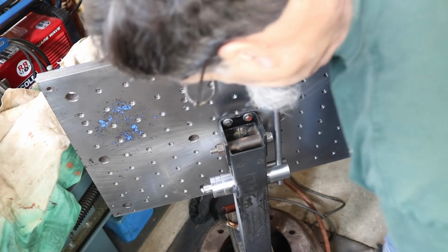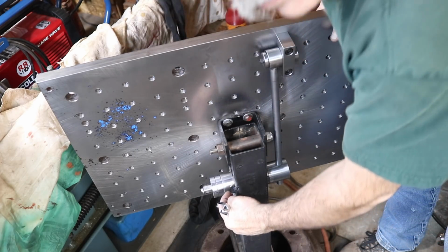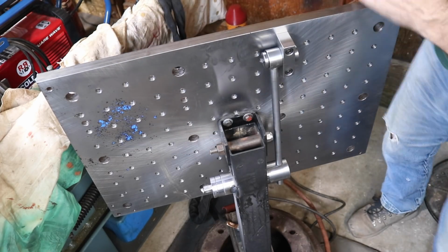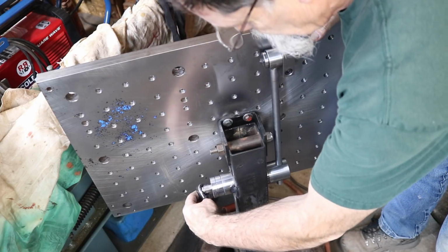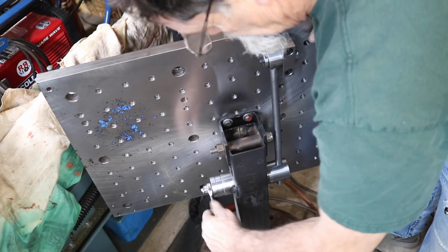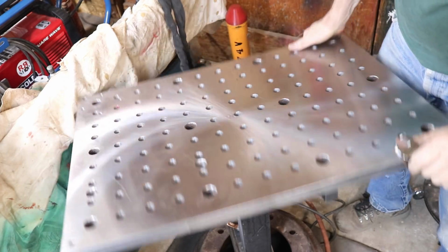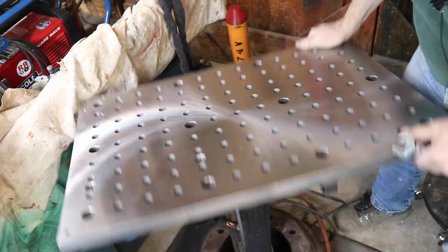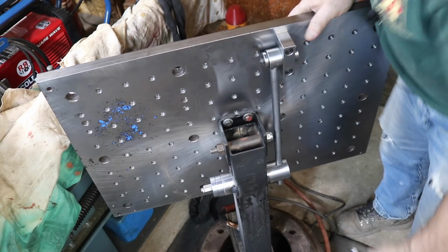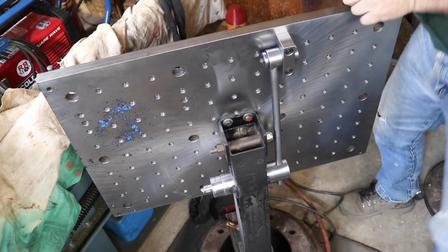We're welded in. It was pretty nice since I could actually just fusion weld that. It was such a nice tight fit, so that's all I did. But anyway, the wrench goes on there, and all it's going to do is take about a third of a turn to tighten it. It works very nice, boom, nice and smooth. And boom. I mean, you can't move it. If I snug it like that, I can't move it at all. So, quarter to a third of a turn.